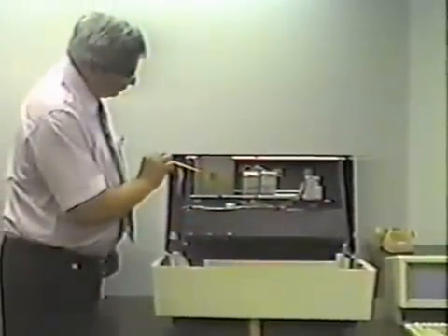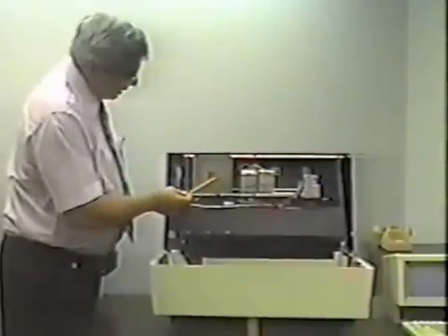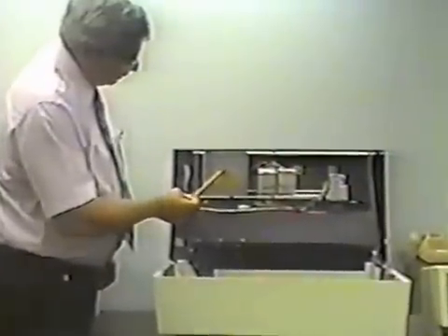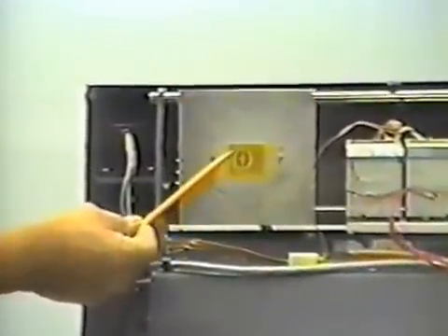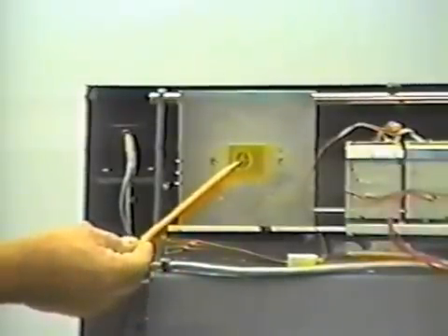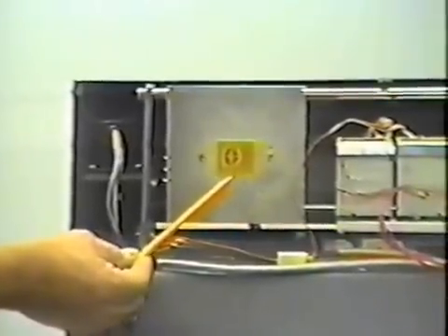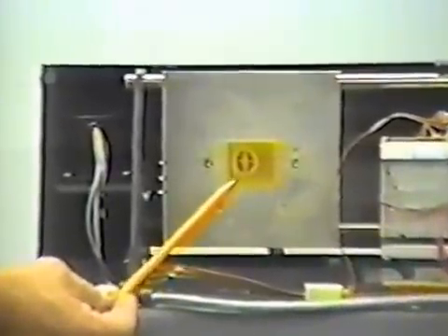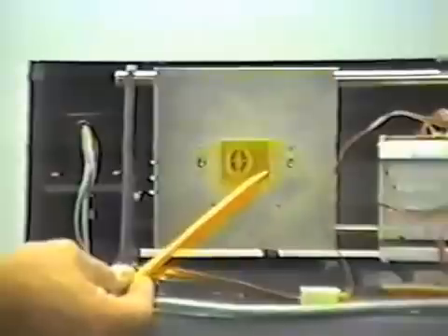You will note that the edges are square and sharp, and the pattern is defined clearly. The circle here is very round and distinct — the cross-members, the small hole in the middle. The support material can be removed by just a temperature differential; it has a slightly lower melting temperature than the primary material and will flow away, leaving you with the finished part.